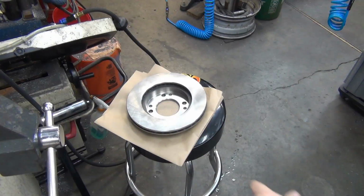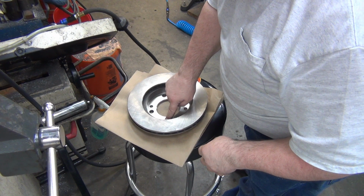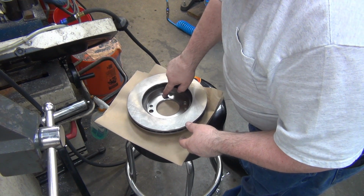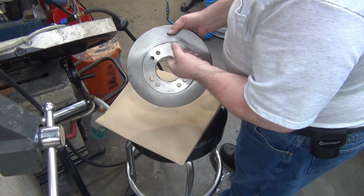and I don't have to worry about the center hole being done perfectly. I'm going to go over and add some chamfers to the backside here. And my holes don't have any burrs. We'll see after the chamfer, but the manufacturer, yes, I think there's a big lip on that one too, so I got to hit it with Scotch-Brite afterwards just to help cut that out.